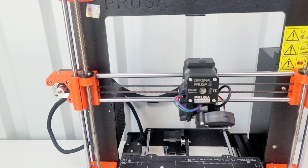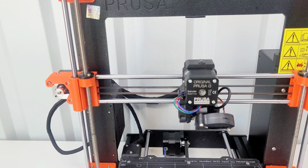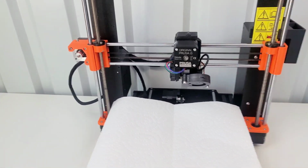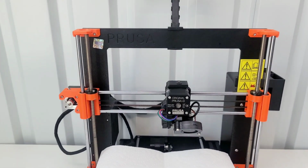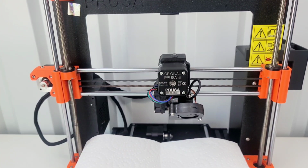It says that I need a cloth or piece of fabric which is thick enough to cover the heat bed. This will ensure you won't damage or scratch the surface during the disassembly. I don't really have any cloth out in here, but I've got some paper towels, so I guess that'll have to do. Set that there. Okay, that should work. Step 3, releasing the cable bundle. I need to open the door and the extruder cable clip.